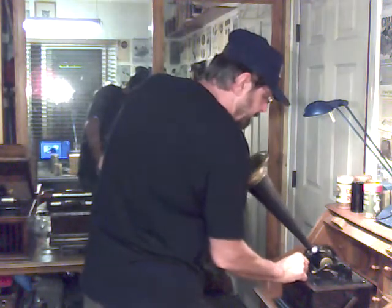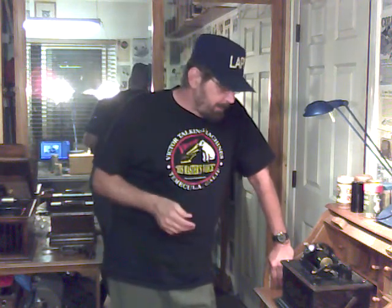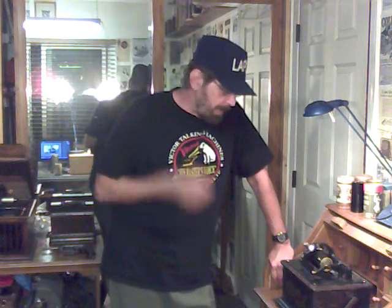So you heard for yourself a decent recording — you don't have to yell, just speaking in a normal voice. This is not possible with an Edison recorder. Using an Edison recorder, even a fairly efficient one, you have to really project your voice to vibrate that diaphragm. It's all based on air pressure and sound waves — to get a loud recording, you have to have a loud input. Input equals output. Unless you have a really efficient recorder, which we do. And you can see these grooves are really well defined on this black wax cylinder.